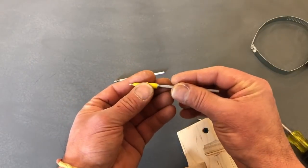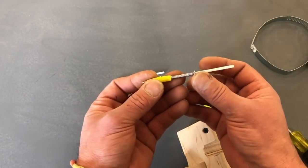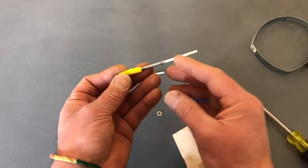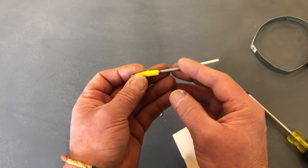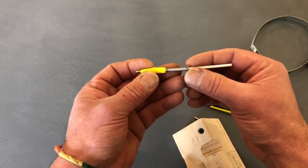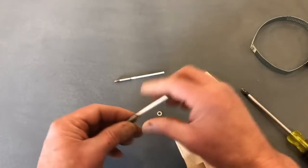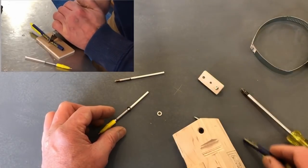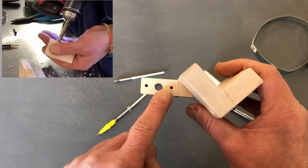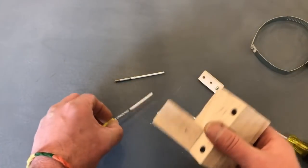After that's done, you stick it back in there, and what you want to do is get a measurement from where the pen body starts to the outside of the washer — in a slightly compressed position, maybe a sixteenth to an eighth of an inch. You take that measurement and that's what you will cut off of the bottom of the pen. You make a matching hole size in your piece of wood and slide the body of your pen up in there. It should come out flush — that simple.